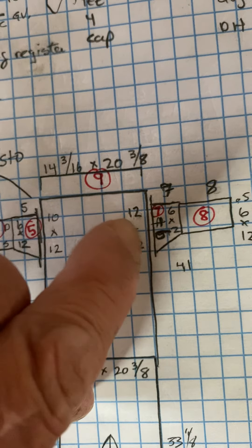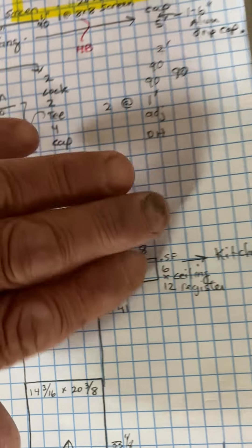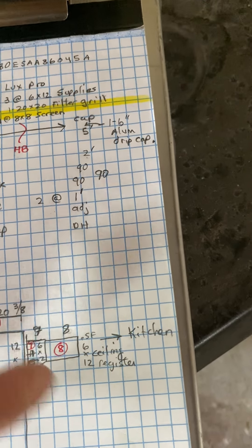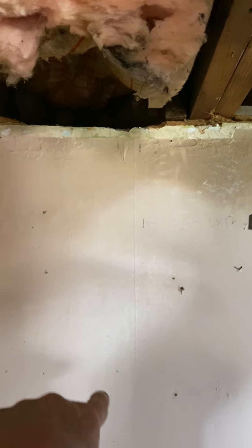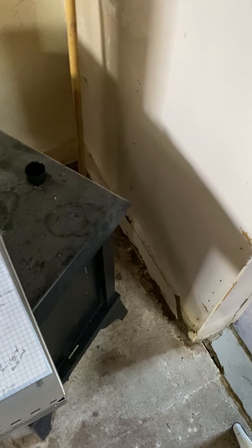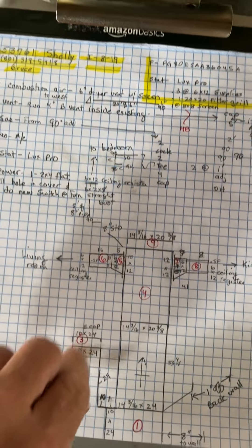In the kitchen here, we will take a run off the side. I made this a 12 by 12 to six by 12 — the front's going to come up six inches, one inch in from the front. I marked it on the wall where I intended it to be. The reason for the offset is there's a gas line going up right here, and a stud right there, so it should be right next to the stud on this side. That's it on the three heat vents and the return.